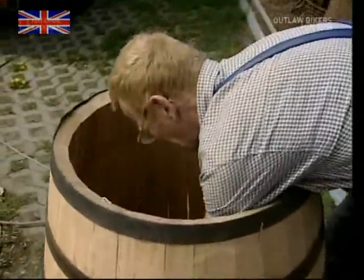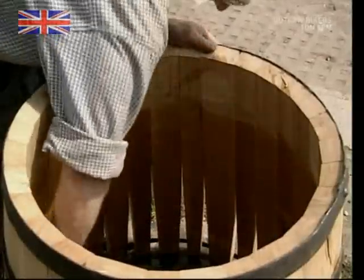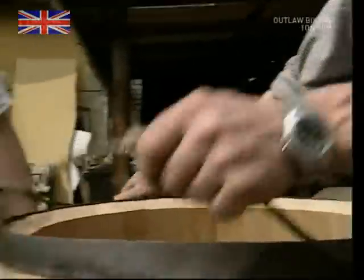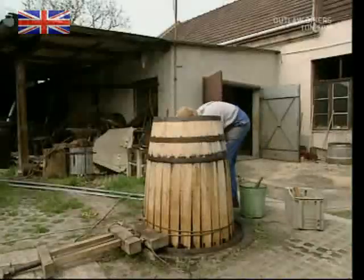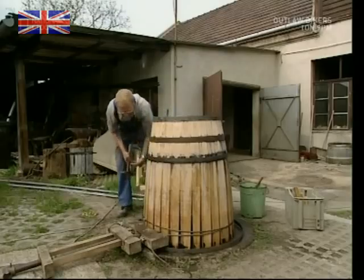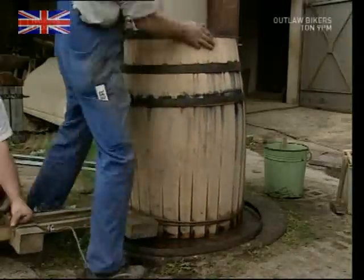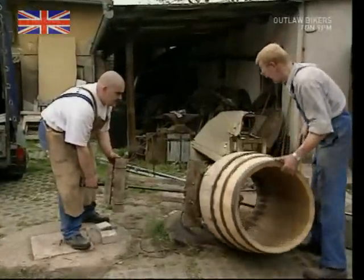You can see the beginnings of a barrel shape, but you couldn't really store any wine in it just yet. First, the staves need to be bent. The cooper lights a small fire in the centre of the barrel and the staves are brushed with water. This combination of heat and humidity makes the wood flexible, so it can be bent. But it's not just a case of bending them in by hand — a large vise is attached and slowly tightened up. It's very, very slow. After about two hours of tightening, you can actually see the barrel shape, even though it doesn't have a top or bottom yet.